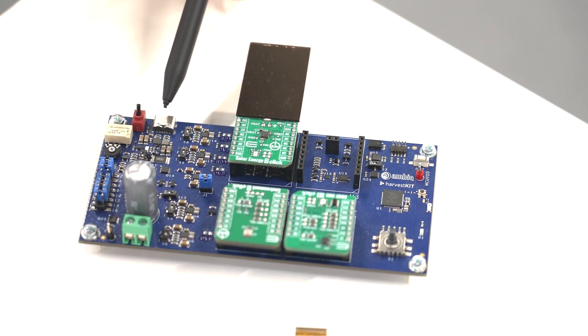The board allows flexible power supply configuration. You can use energy harvesting sources to supply the board, as well as the USB-C connector, which has priority in debugging and programming of the microcontroller. The board provides a 10-pin ARM-compatible debugger socket, so it can be used with many ARM-compatible in-circuit debuggers available in the market, as well as our own low-cost in-circuit debugger based on J-Link, supporting our own microcontrollers.